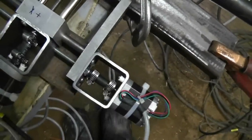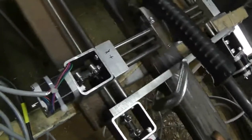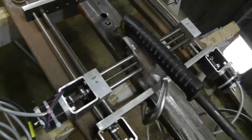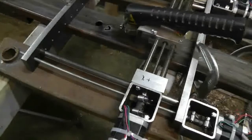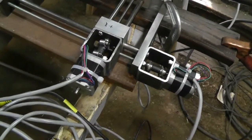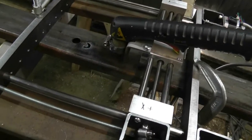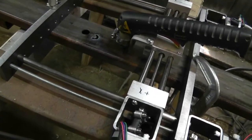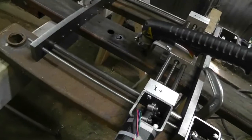I think what I'm going to spend some time doing right now is working on speeding these things up and setting the default number to a bit higher. It's taking an exceptionally long time to traverse. I just told it to move one inch and it's obviously going pretty slow, considering that's 20 turns per inch on that lead screw or threaded rod. It's taking minutes. I also think my calibration might be off because it seems to be moving a lot further than I would have expected. I think it's off by a fair bit, but I'm going to sort that out once I get the speed to a reasonable number.